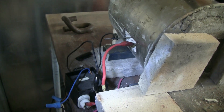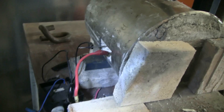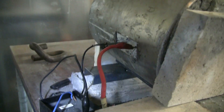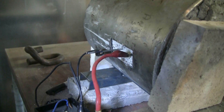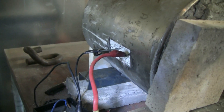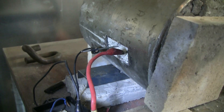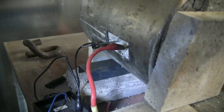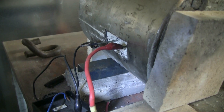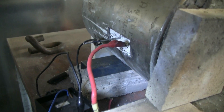Today I decided to add electric ignition to my new forge. The modifications are a little hard to see here, but I cut a rectangular opening in the stainless steel side and drilled two 1/8 holes through the refractory. I stuck a thin TIG tungsten electrode through each hole as spark gap electrodes.